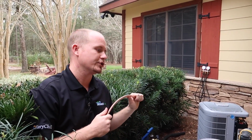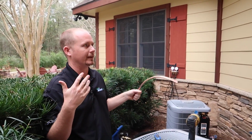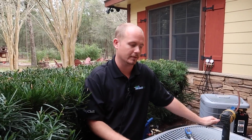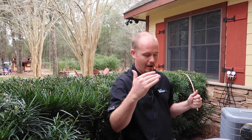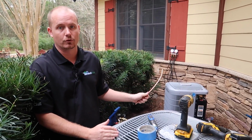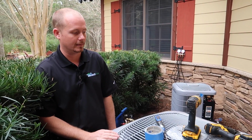So when we think of hot, cold, boiling, condensing, all these types of things, we're used to thinking of it in terms of air at atmospheric pressure, where we're doing it with refrigerant at controlled pressures, so we can control the temperatures that happens at. And so by how we charge the unit and by how the orifices open and close, we can decide exactly what temperature we want that indoor coil to be, to control both humidity, which is the dew point of the coil, and the temperature of the indoor air.